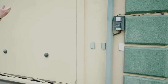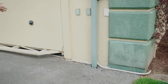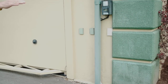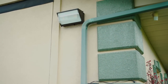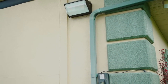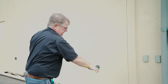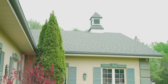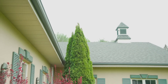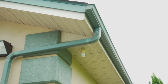If you look at this drain, the downspout goes right into the ground, and then under the ground it picks up the drain, which takes the water away. So we can't get in. So what do we do? Well, if you're doing a system and you're doing a roof system, you can of course bring the heating cable right through the downspout, and down we go, and you can draw it in with a fish tape. However, if your roof materials don't require freeze protection and you're only wanting to protect the drain that goes out, here's another way that you can do it.